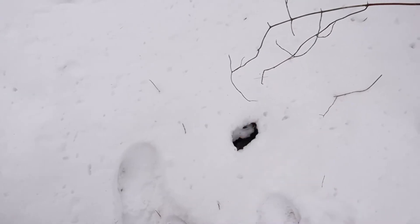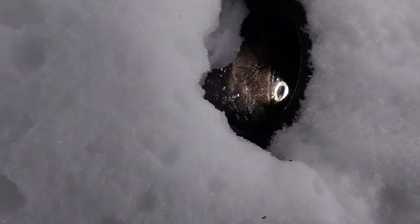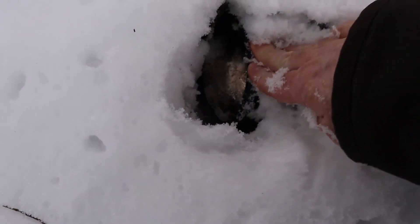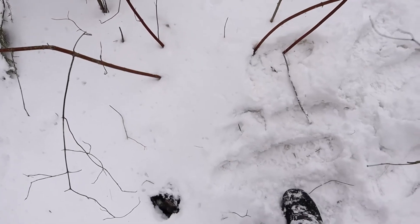I'm going to place the receiver on the ground — it says I'm 11 inches below where I am, and the camera head is just ahead of there. You can actually see in the snow where that drains out — it's melted away the snow here. There's my camera head right there. So now I know that this line is clear. It actually tips up a little bit, so once this snow thaws we'll inform the homeowner that they should come and basically tip this down and fix this up a bit. I've now located this line from the house all the way out to here. We know the line is clear, there are no issues, and the homeowner is safe to keep using this sump pump.